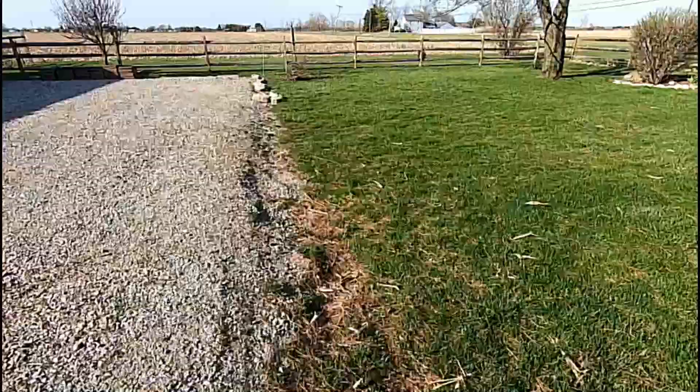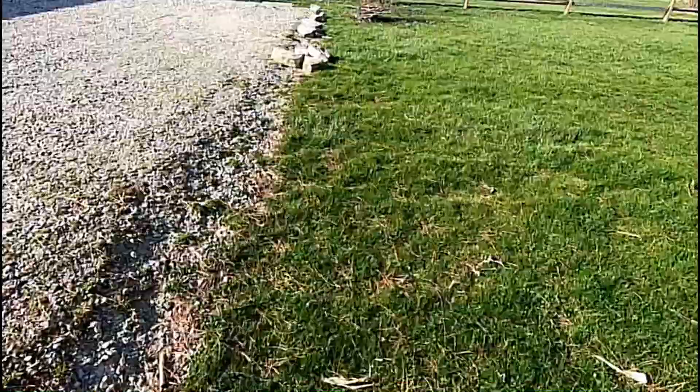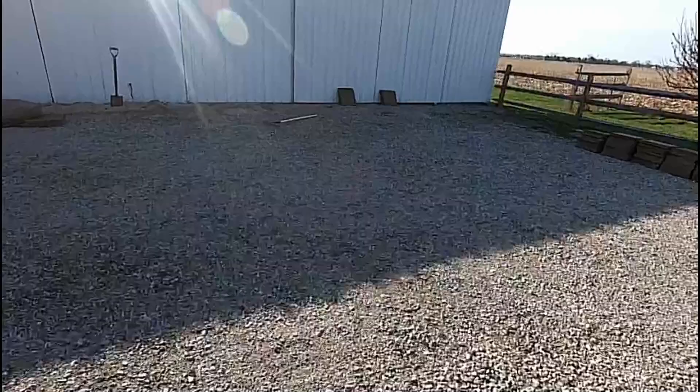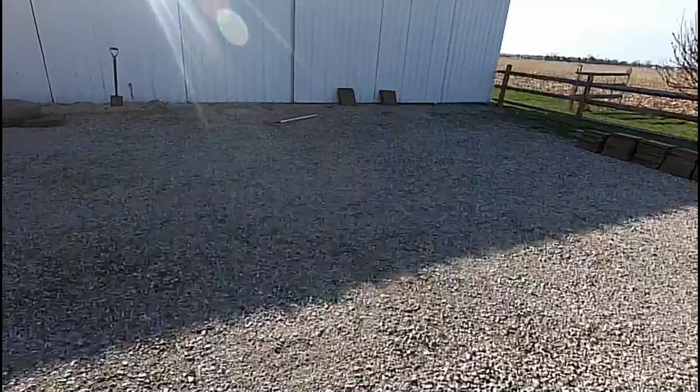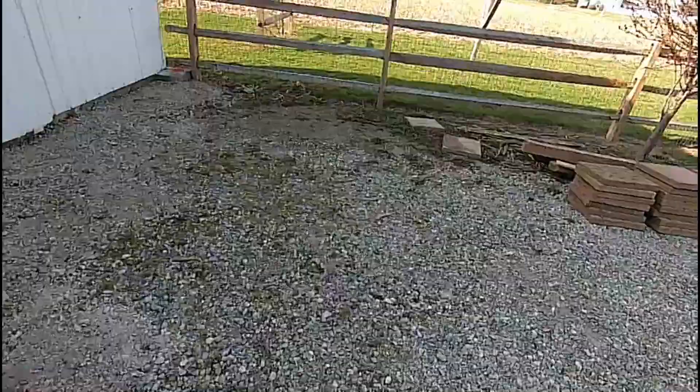The building itself — they've raised a whole bunch of gravel and the actual ground level is like 10, 12 inches down below. So what's happening is water is getting right next to the face of the building. We don't want it pushing in. There's already a whole bunch of rotten wood. They've covered it up — this was all just buried in there and it was like a sponge. We could have squeezed it out. All that broken and damaged wood in there attracts all kinds of bugs and everything else.